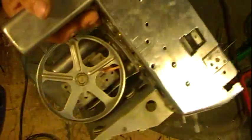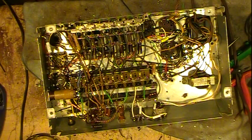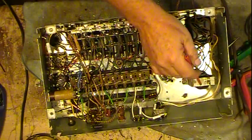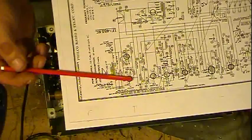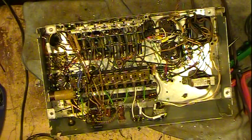So that's where we're at on the radio as it stands now. Something I wanted to talk about — I have a plan on this radio — is how the push-pull works here. Obviously you didn't see anything on top or bottom, there's only one audio transformer, it's the output transformer. There's no interstage, and when you look at the schematic there is no phase shift or phase changer tube or anything. It's basically using resistors and resistor coupling to phase-change, so one tube is going positive on the output while the other is going negative. I kind of drew it up on the whiteboard.